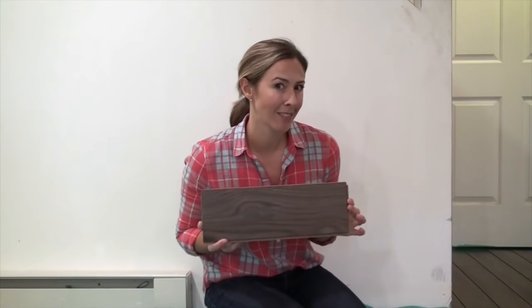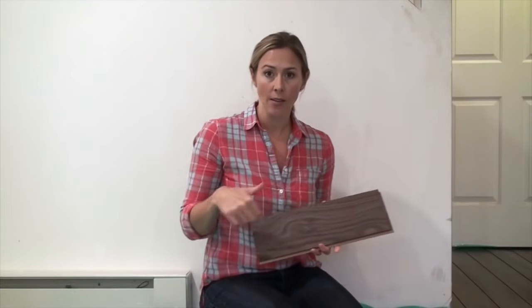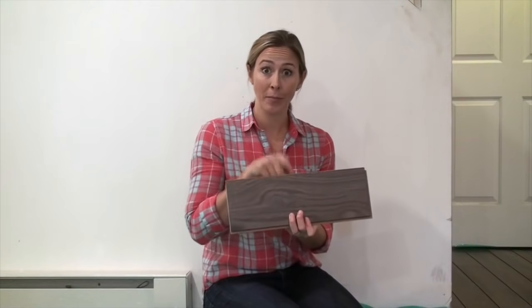Once you've laid that last piece in your row, you'll have a scrap piece left over from the cut — it's not really scrap. Hold on to it as long as it's longer than 12 inches, because you're going to start your next row with it. That minimizes waste and also makes sure that the seams in your flooring are staggered — they're not all lined up, and that's the look you want. Use the cut piece remaining from the end of your last row to start your next row, then just keep laying the flooring tongue and groove.